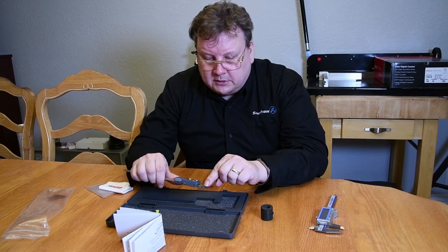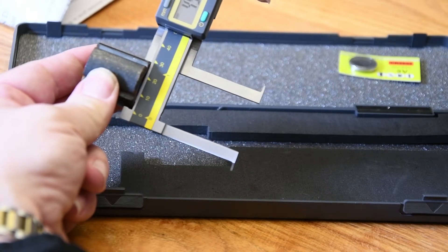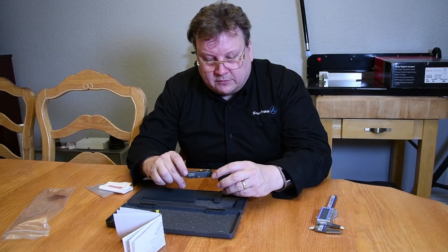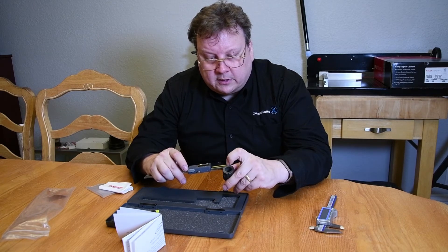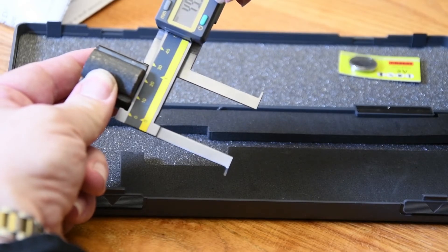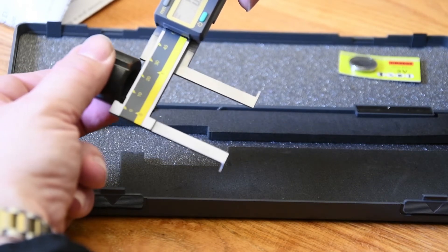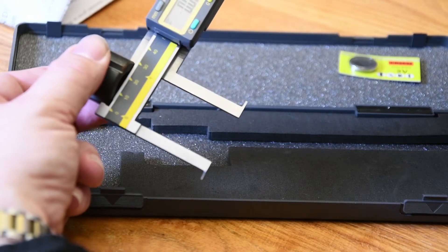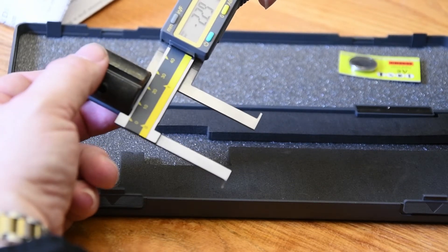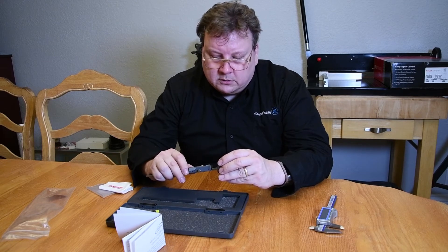On the top there's a place to measure outside diameter, so if you have a pipe you want to measure the outside diameter, that's what that's for. You can also do a relative measurement that way. For example, to measure the difference between the outside diameter and the outside diameter of some indents, put it over the outside and hit the zero ABS button — that makes the relative zero the outside diameter. Then change to where the grooves are, push back in, and you get about 2.16 millimeters difference between the two.